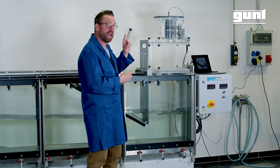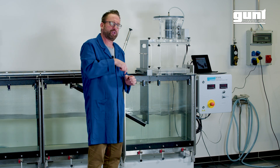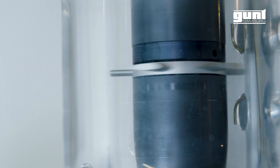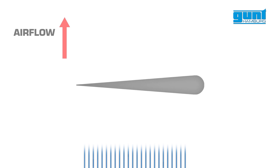The Wells turbine has one very special feature: it turns only in one direction regardless of whether the air is coming from below or above. The Wells turbine uses a fully symmetrical airfoil for the turbine blades, and the symmetry axis is horizontal.